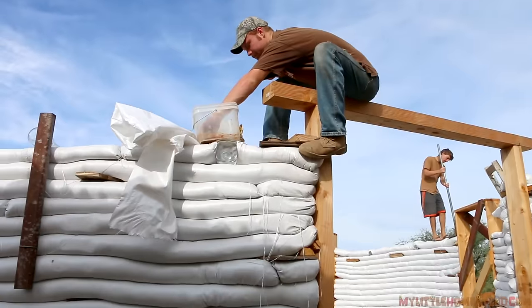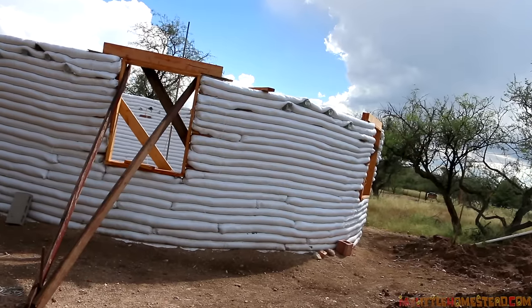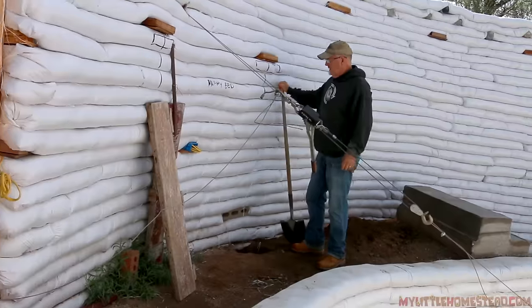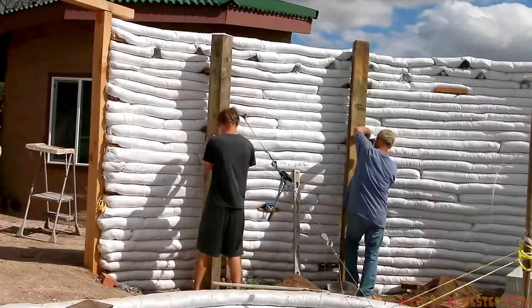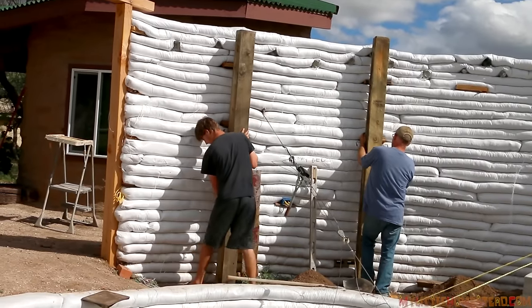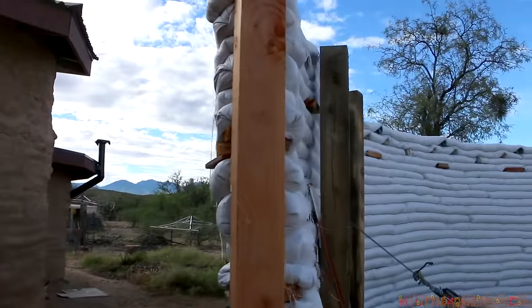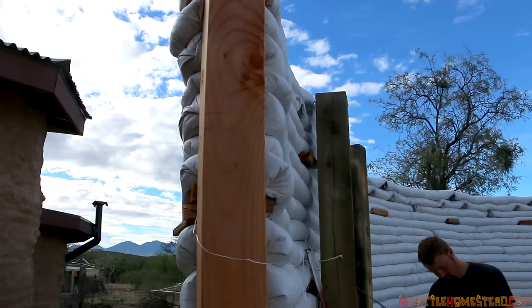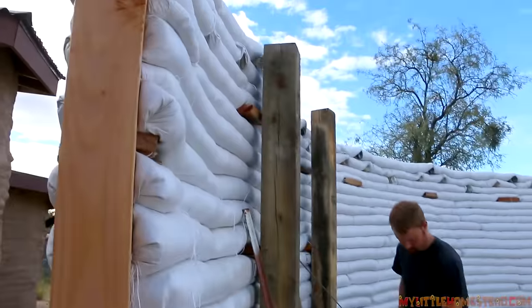It seems like the areas around the windows where we had the cleats, those walls stayed pretty close. We're digging some holes to put posts here to hold up our Murphy bed. We not only get posts for the Murphy bed but also posts for the wall — it's going to help support it. They're six by sixes and we'll be able to drill a hole through them. Same idea through the bag, with some kind of plate on the other side to help drive it back. It didn't really move at all. That's good.